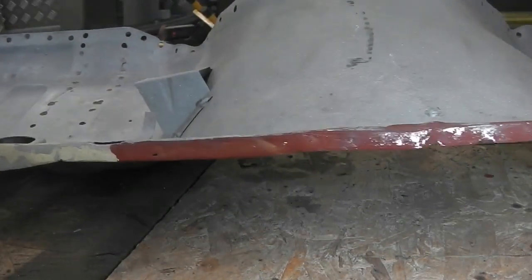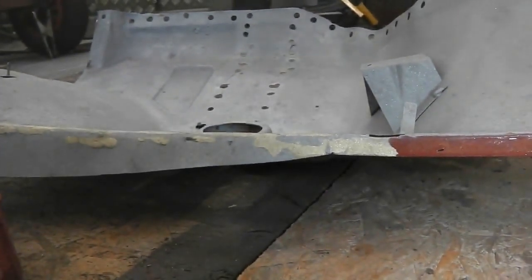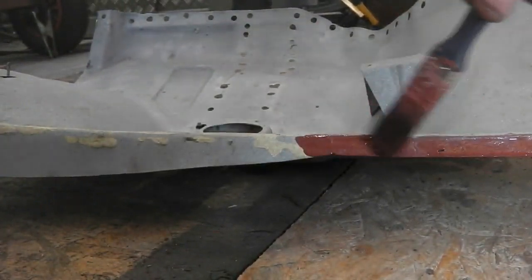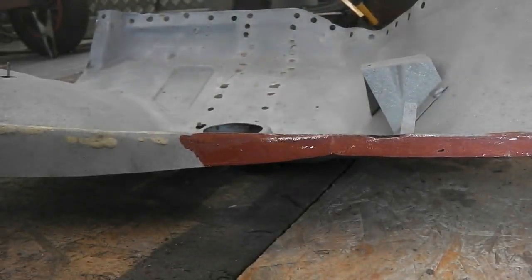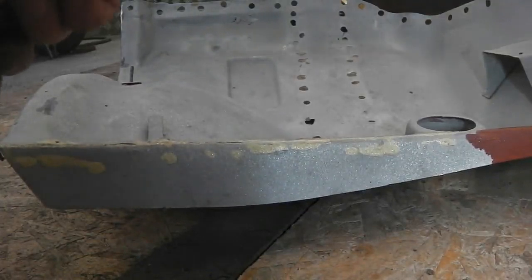We've got some braze lines down this edge where it's been repaired, so we have to be careful and wary of those when we do the plugs. Some may need an actual braze plug as opposed to a MIG plug, because the MIG will bounce off that braze. But no problem, no problem.